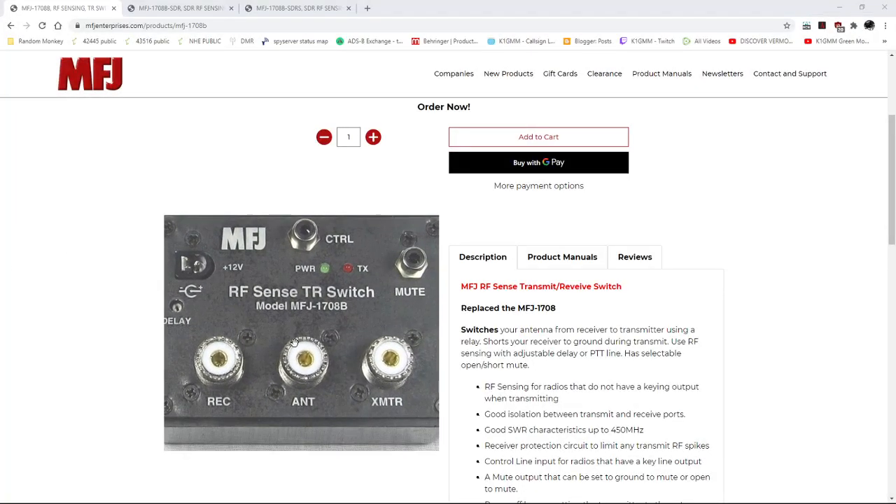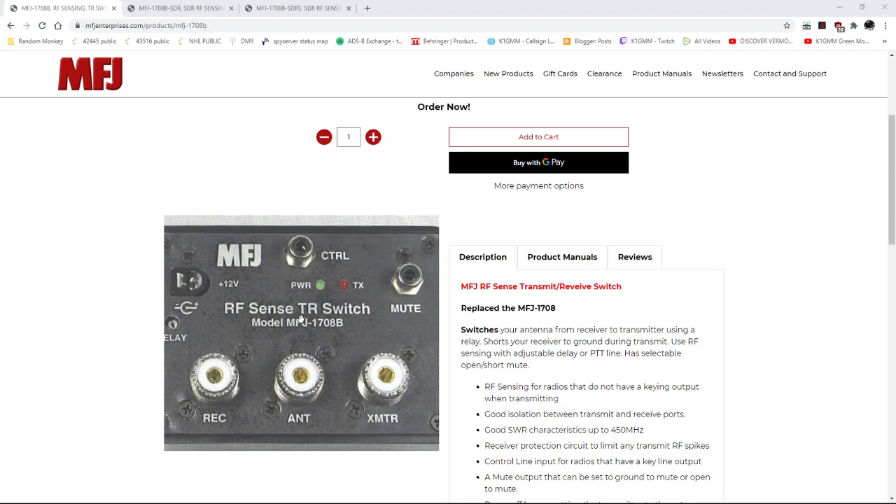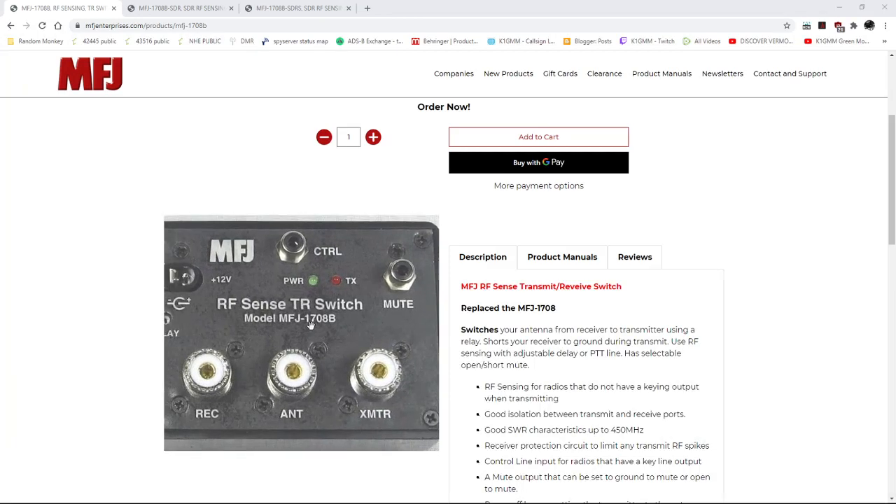Let me show you the differences. This switch, I believe, is designed to be used with just like a secondary transceiver, so to speak. This is not meant to be used with an outboard SDR receiver. Could you get it to work? Maybe — we haven't been able to. Supposedly there's a jumper connection that needs to be made inside to allow it to work, but it does not work. Inside this switch on the board there is a ferrite choke, which I believe is tied to the jumper 3 connection, which is open — there are no jumpers in jumper 3. There are four jumper sections in this switch. Also, this switch is a revision zero board. Again, this will not work — it is not designed to work with an external SDR receiver.